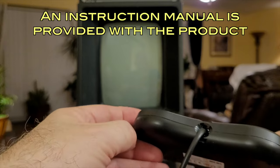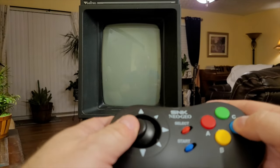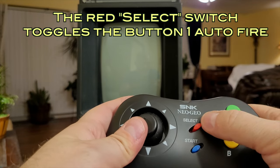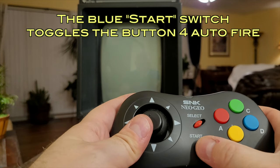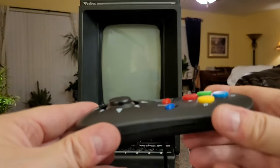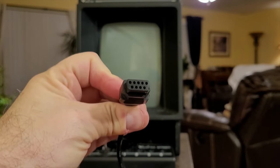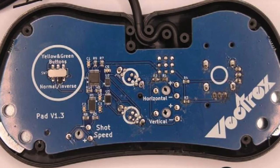This work started out by a request for his input by the M05 Association over in Europe. The project uses the shell of the Neo Geo Mini Pad that SNK makes, along with the thumb pad assembly which has to get desoldered off the original printed circuit board. Nicolas, who goes by the handle Gweemly on GitHub, has been able to manufacture the PCB and cable that connects it to the Vectrex using a plan that is open source. This cable is about four and a half feet long — a nice long cord that has the perfect end that goes right into your Vectrex. The Vectrex cord along with the printed circuit board totally replaces the old PCB and cord of the Neo Geo Mini. Once swapped out into the controller shell, all that has to be done is to solder on the thumb pad assembly, and the controller is ready to roll.